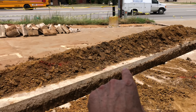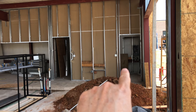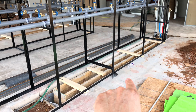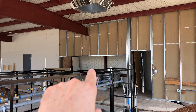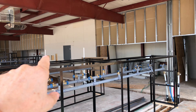We'll start up in the corner. You can see the saw cut out to the city sewer, out to the landscaping, and then the water closet with the temporary power. The racks have been put in place — these are getting poured in for the in-ground troughs, and the fur down is in for the first set of dryers.